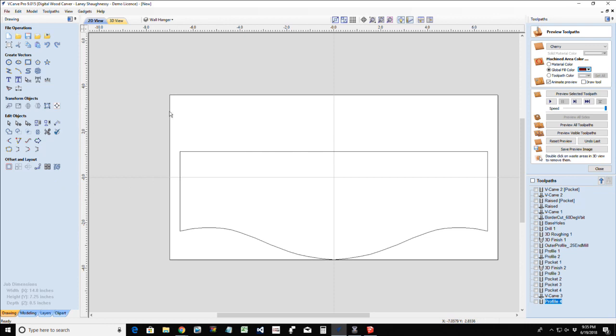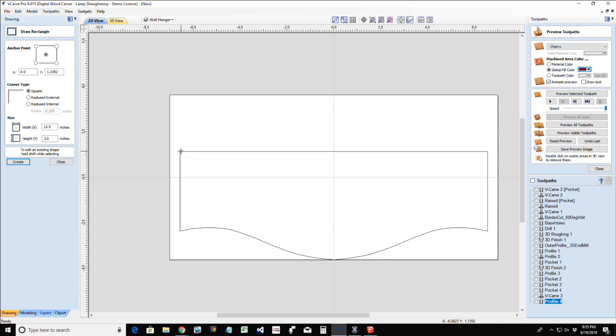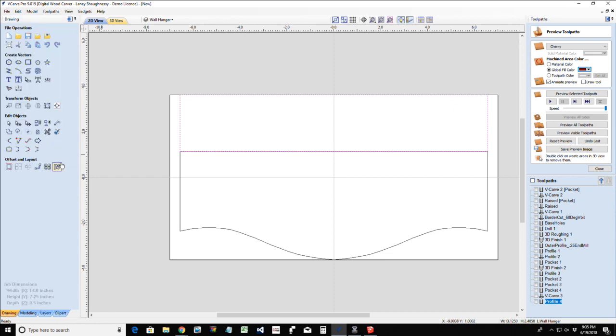here in this upper part, I'd like to do some kind of 3D work. And so I'm going to go ahead and draw another rectangle. I'm just going to snap it and keep them separated so I have different boundaries for my model cuts, so I can use the selected vectors as the boundary, right?